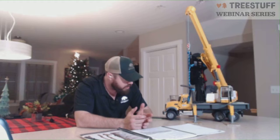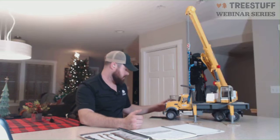But in theory, if the crane became under contact with electrical power and became energized and the operator stayed put, they could be okay. I'm not going to say 100% they would be because there's so many variables involved there, but they could be in theory okay. The best thing would probably be, if you're not hurt, just stay where you're at. Trying to climb off the crane to get down actually creates a higher hazard than staying put. Gotcha.